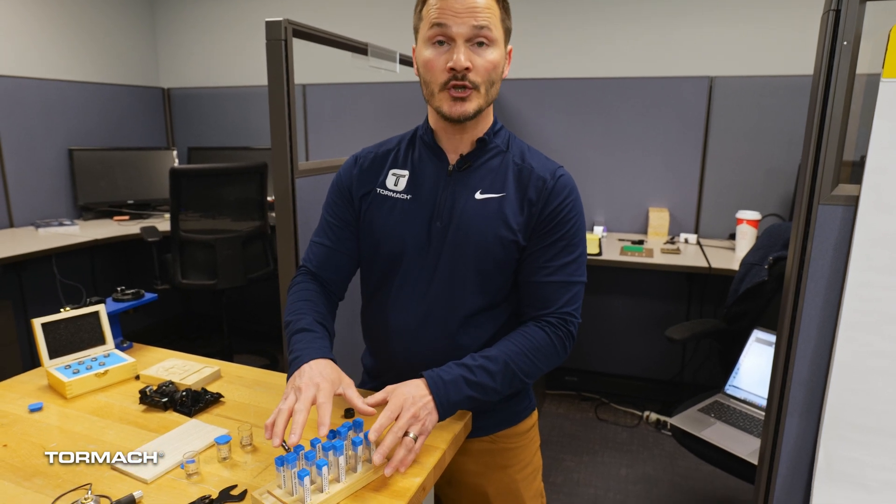Our XS Tech comes with 1 and 2 flutes because most of the materials you'll be cutting are either woods or aluminum. Softer materials don't need as many flutes — we need something that's going to come around and chop into that material and cut it out as fast as possible. One flute is going to cut through softer material like wood faster. If I use 2 or 3 flutes, I'll get a better surface finish, with each flute taking a little less material each time. If I need to hog out material, I'll use less flutes and cut through faster.